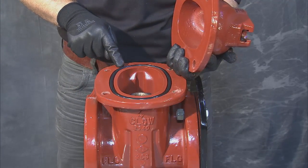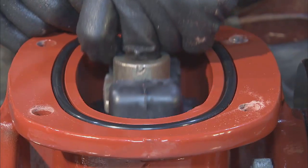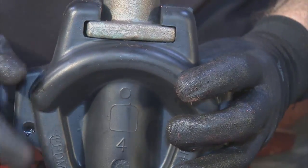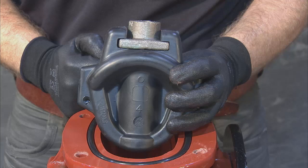This will expose the inside of the valve and give you access to the wedge and stem nut. Next, remove the wedge, lifting it smoothly up and out of the valve. Inspect the wedge for any damage, including cuts, punctures, and indentations along areas that seal tight to the body of the valve. If you find any imperfections, a replacement wedge might be necessary.